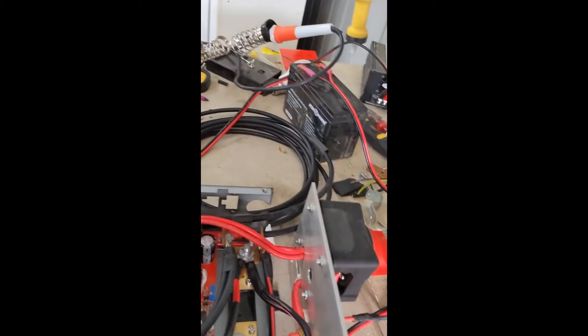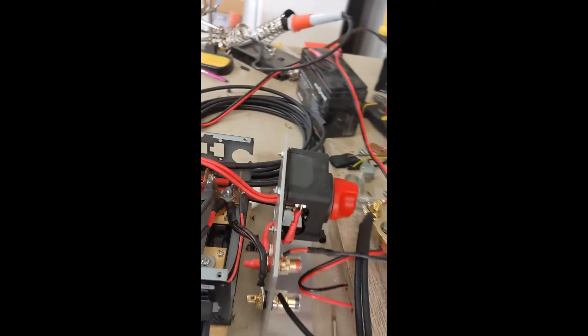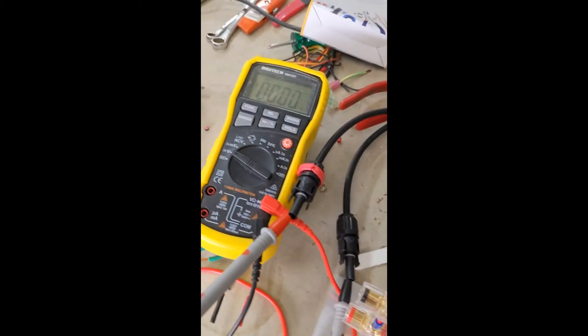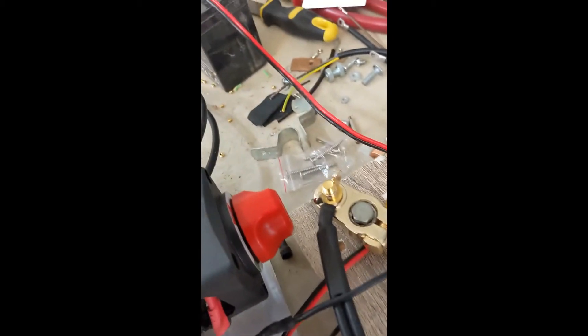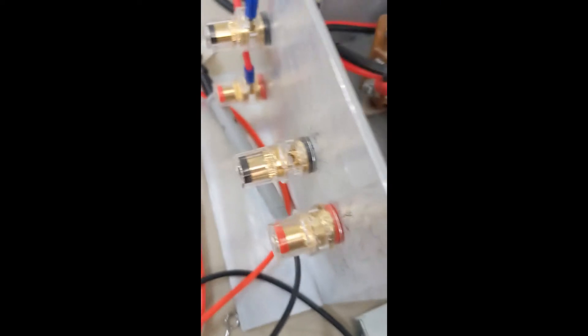Just one last thing — to see what kind of voltage we get, I'll turn off the load of the battery charger just to be safe. We're currently reading zero volts on the PV output — red on red, black on black — and we have the isolator switched to the off position, so we're not dumping. We have no wind connected, just the battery.